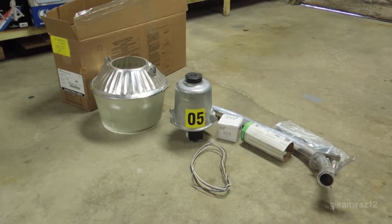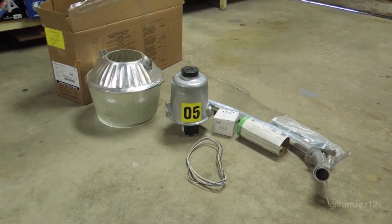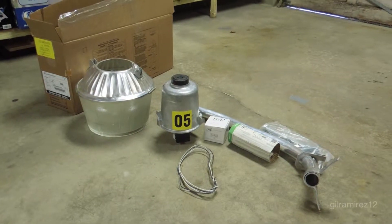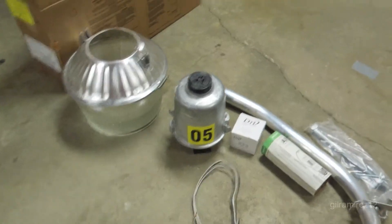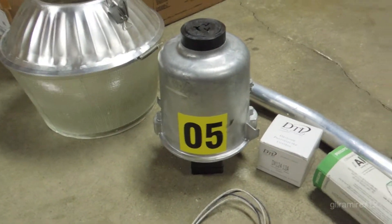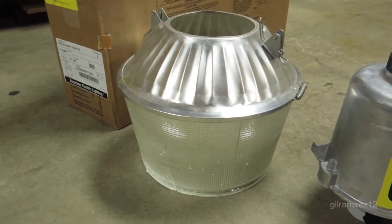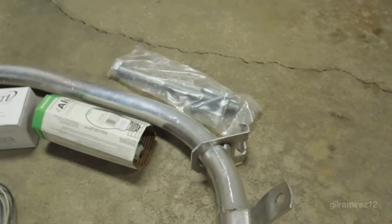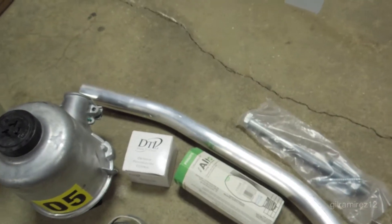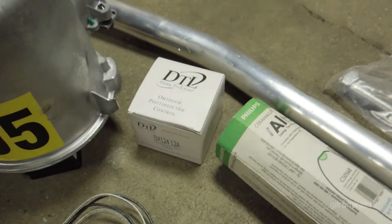This is my American Electric 11 series NEMA light, 50 watt HPS package. I custom ordered this light package from the factory along with my 325 series light. The package includes the NEMA head itself, which has a 50 watt high pressure sodium ballast, the refractor lens which is glass type 5 distribution, a mounting bracket and hardware which is 24 inches long, the lamp, the photo cell, and the supply wire.